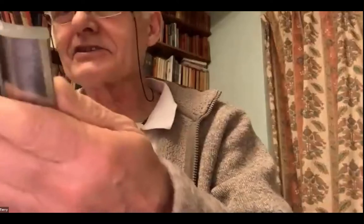A spindle roughing gouge should be ground straight across. Here we are. I, for some reason, always have liked a shallow roughing gouge. I've had that one for 40 years. There's still lots of it left. And that's sharpened on a platform. But you see it's straight across there. The corners need to be kept sharp. If you over-roll it on the grind, you will lose the corners. They'll be cut back a little bit, and that will affect its use for some purposes.